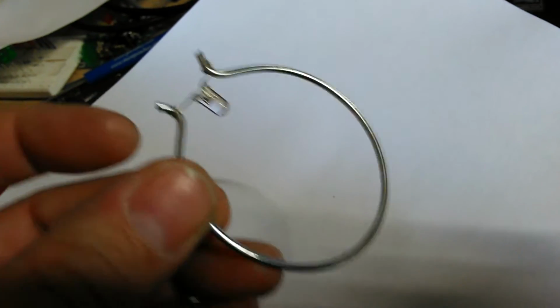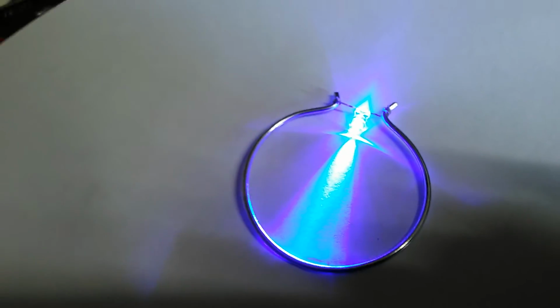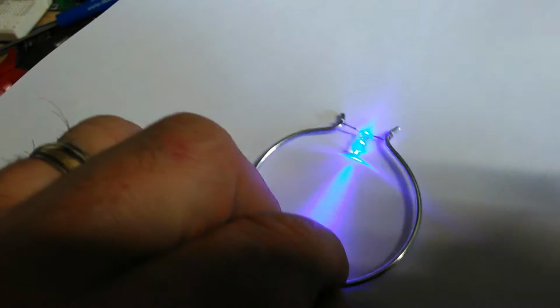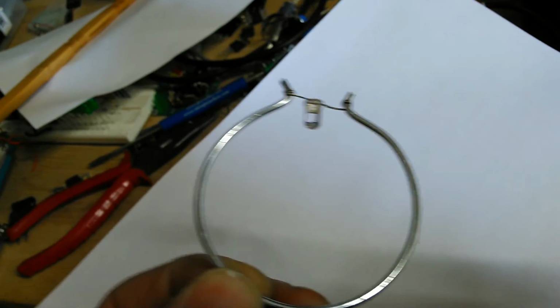Anyway, that 130 volts that's measuring is what's measured across the actual primary coil. So that coil, the length of the wire on that's 14 gauge also, but it's about 4.5 feet long, coiled around a 2-inch PVC pipe. That is how I got the form. Same for the single turn on this.